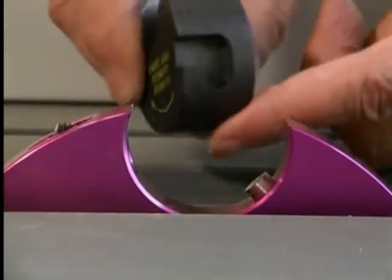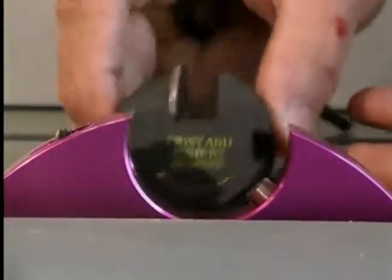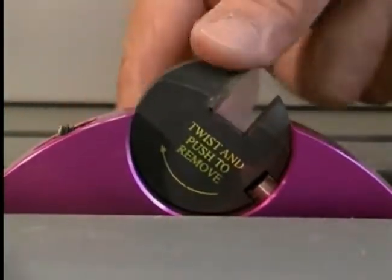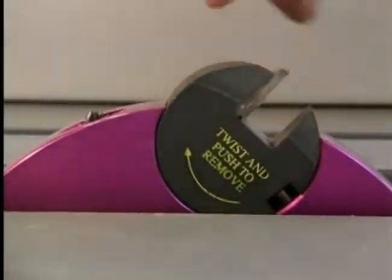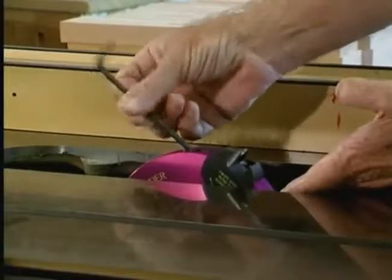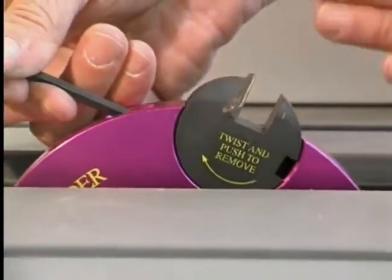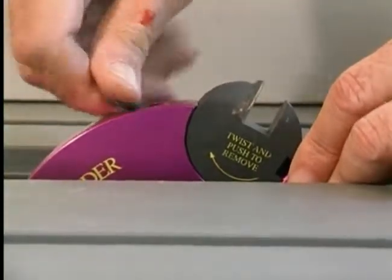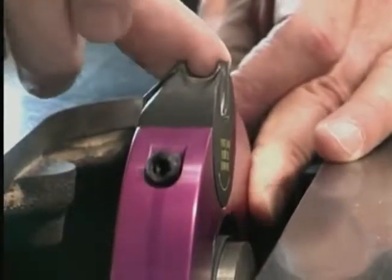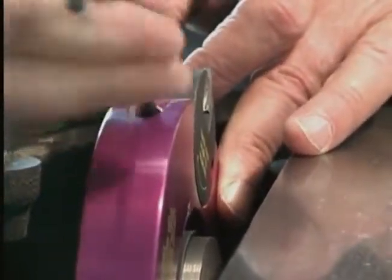Slide the plug from the side, not from the top. Line up the beginning of the L-shaped groove with the pin. Do not force the plug into the cavity. Gently slide the plug over the pin to its maximum depth. Twist the plug into the lower portion of the L-shaped groove until the plug stops in its final position. The next step is to index and lock the plug into place. Tighten the set screw down into the hole of the plug. Now the detail plug has been installed, indexed and locked into position and cannot be ejected from left to right or from the top of the head.